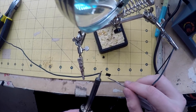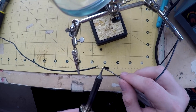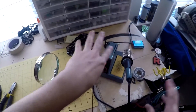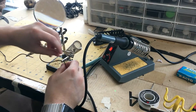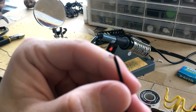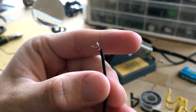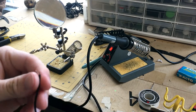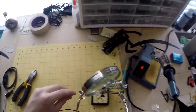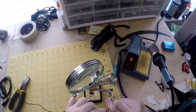Same thing on the other wire. Wipe the excess off. It's a little bit sloppy, but I've got the solder on both sides. Make sure they don't cross together, otherwise they're going to short — it's happened to me. It hasn't caused anything to specifically not work, but it's a good idea to avoid it. What I notice on the radio is it just doesn't work the way I was wanting it to, or the channel will be muted.